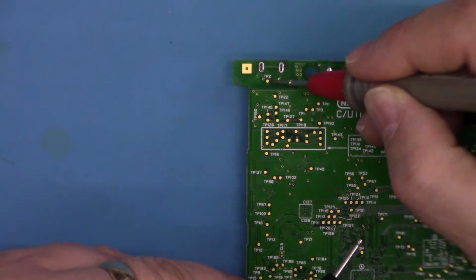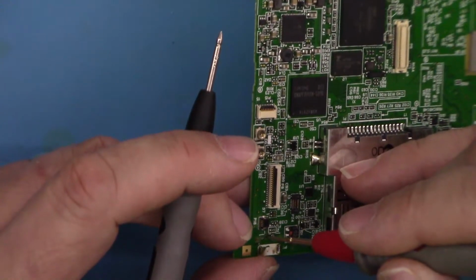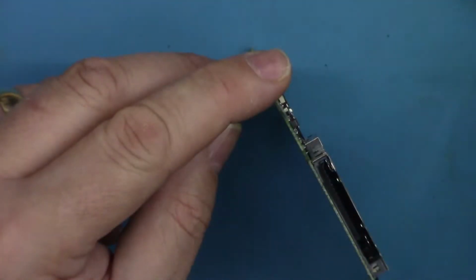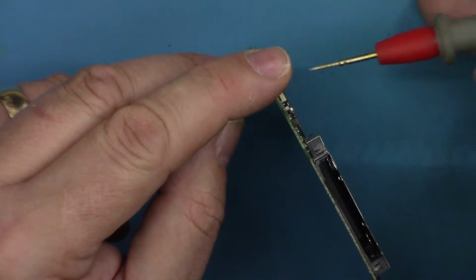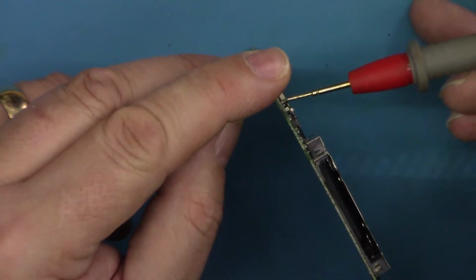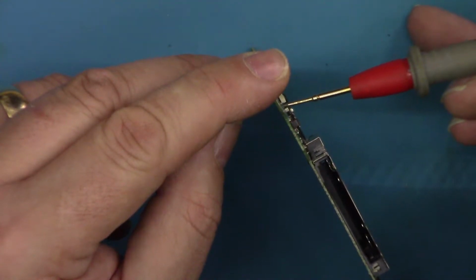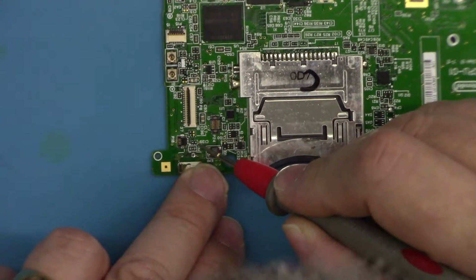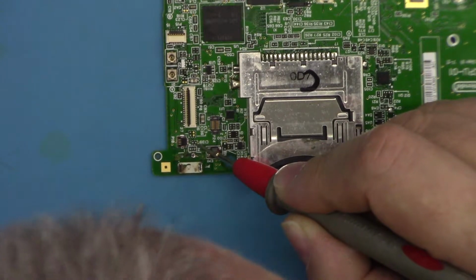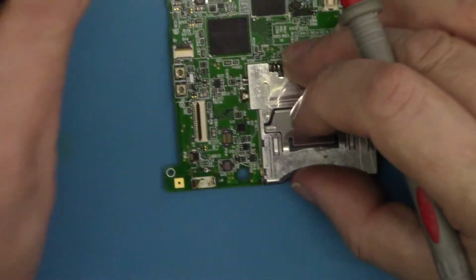Test point 2 goes to the VIA. Right, so that's in test point 2, and now if I can find that fuse, it's not connected there, but it is connected there, so it's connected to that point there, so I could run a wire from there to there. That should create the connection back.